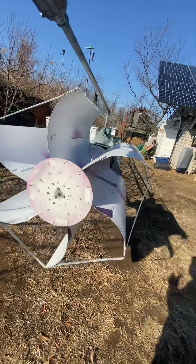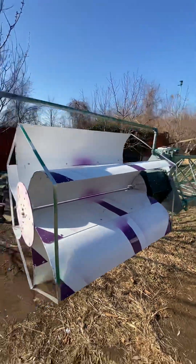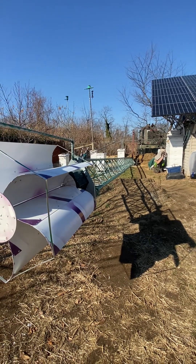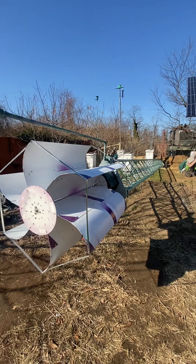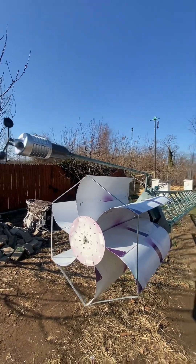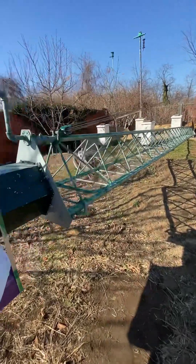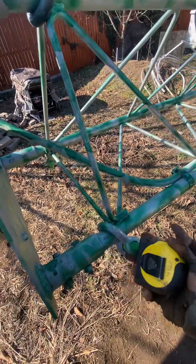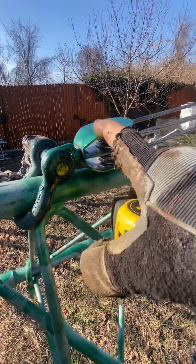Anything else on the tower build? The overall cost from everything you see here all the way to in the ground was $10,500-plus — a few bucks here and there on little things I forgot to add in. That includes the $75 anemometer and the pipe and fittings. These shackles are rated at 6,000-pound pull, well overrated for what's needed — especially since the hardware is only rated for 880 pounds.